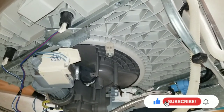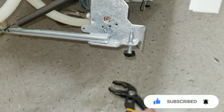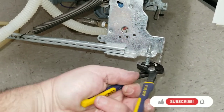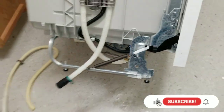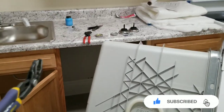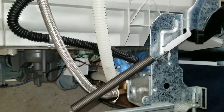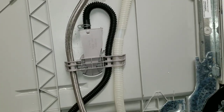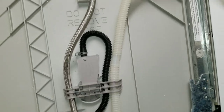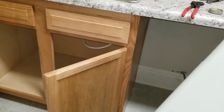Here are the basics on the dishwasher. If you've got any problems, here's where the parts are going to be — right here on the very bottom of the dishwasher unit itself. Depending on how high your countertops are, that's what these little feet are for. You can easily adjust them, usually by hand. If they're a little stuck, take your pair of pliers and loosen them up. Stand the thing straight up and down, put your level on top — make sure it's level, and also make sure it's the right height to slide underneath your countertop. I like to reroute the lines a little bit: supply line on the bottom, drain line on top. Follow manufacturer's recommendations — this is just how I do it. I bring the supply line up through on the right, move the drain from the left to the right. That way when I get over to the sink, I know exactly where I'm going to run them — shortest distance between two points to hook everything up.